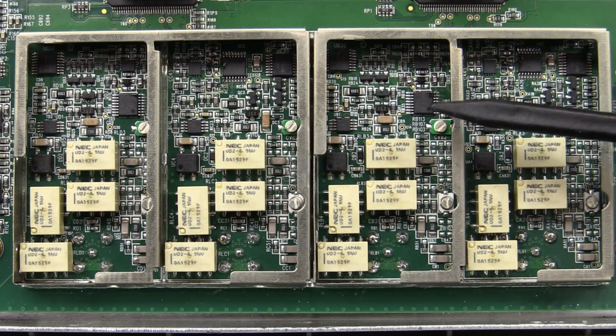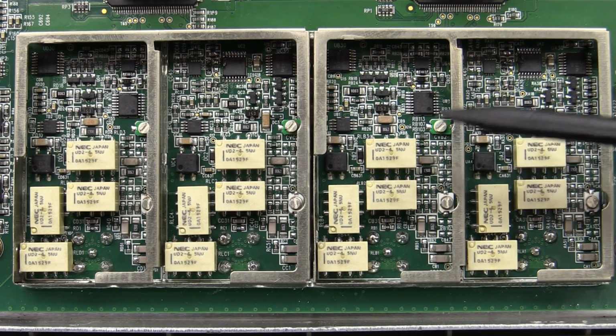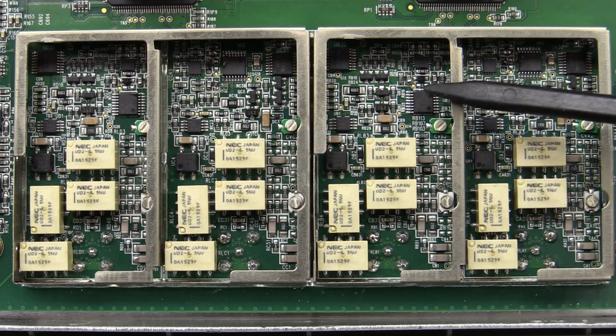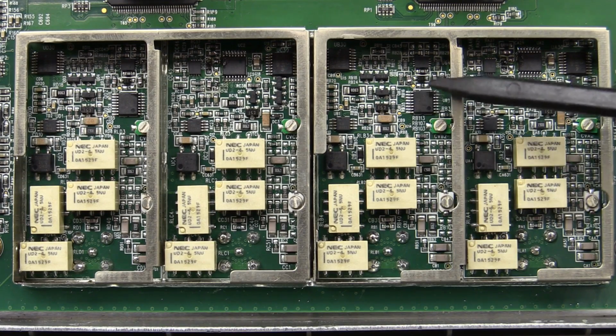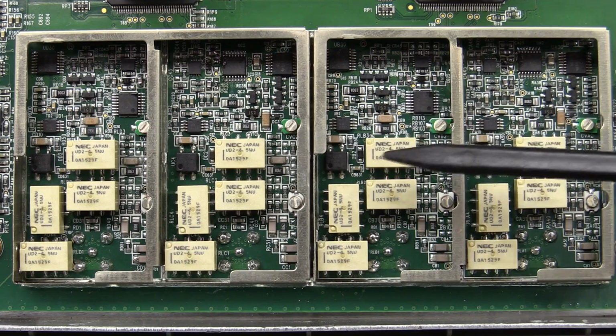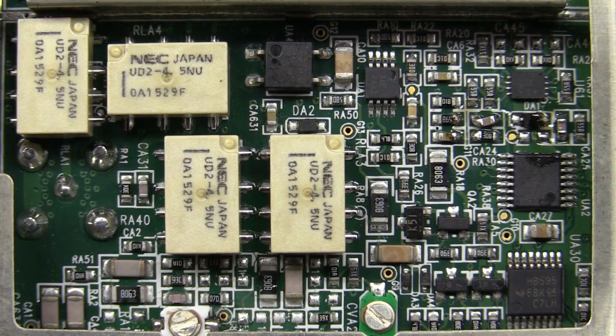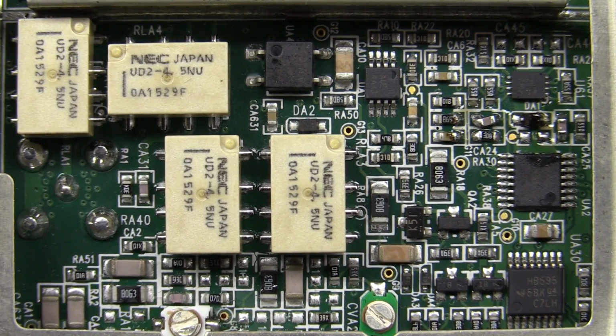Even, I'm pretty sure, even the 70 megahertz model would have the 300 megahertz hardware, and it's just crippled in software. So they're either doing it in software, or like some of the early Rigol units, they're actually doing it as a filter in hardware on the front end. And yes, I will provide high-res photos on EEVblog.com for those playing along at home, but there you go. Not much to it. Until I take the whole main board out, might see a bit more on the underside.